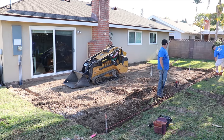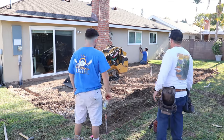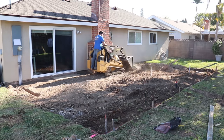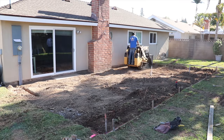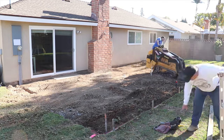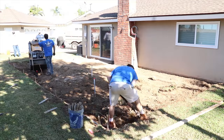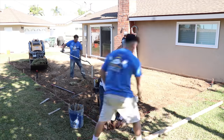We want the water to slope away from the house. In order to do that we had to go below the existing lawn level, which is pretty typical in older houses where everything's been growing for years — lots of build-up with tree roots, elevation changes from the original design. We're cutting it down, removing some roots as you can see buried beneath there, working around all these stub-ups, trying to avoid the open trenches. I'm going to over-cut a little on the edges so we can get our forms in easily.